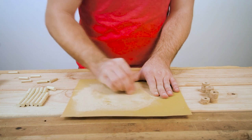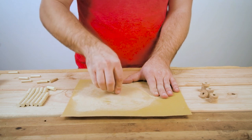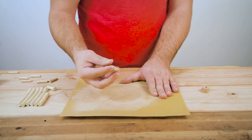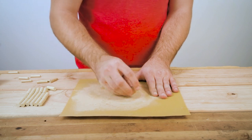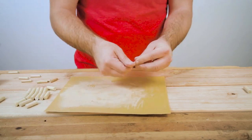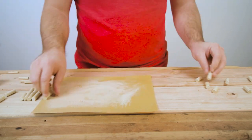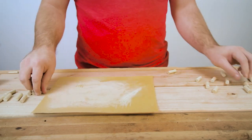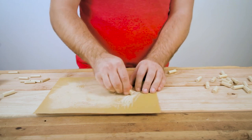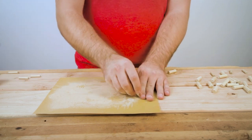To clean up all the more rounded edges, I just use my wrist to follow the contour against the flat plane I have my sandpaper against. For all these little round stops, they don't need to be perfect — just a little cleaned up. Off the machine, I also grabbed some three-eighths inch dowel and quarter-inch dowel for the final assembly, cut them all to one and one-eighth inch lengths, and added a small chamfer to each dowel so they slip in more easily rather than fighting against a sharp edge.